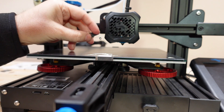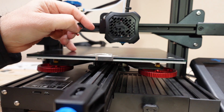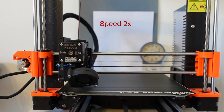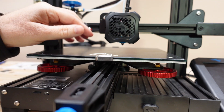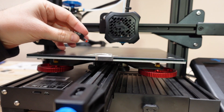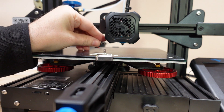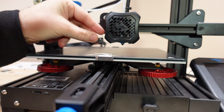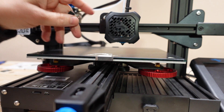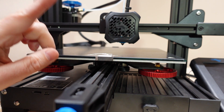When leveling the bed, the probe has to be lower, because otherwise the nozzle would hit the bed surface. This is what BLtouch does — it's just a switch which pops out, touches the contact surface, and when it touches the bed it goes back up. Now the reference point will be the printing surface, which is great because it's independent of the thickness of the plate. We can swap printing surfaces of different thicknesses and it will always know where the top is.